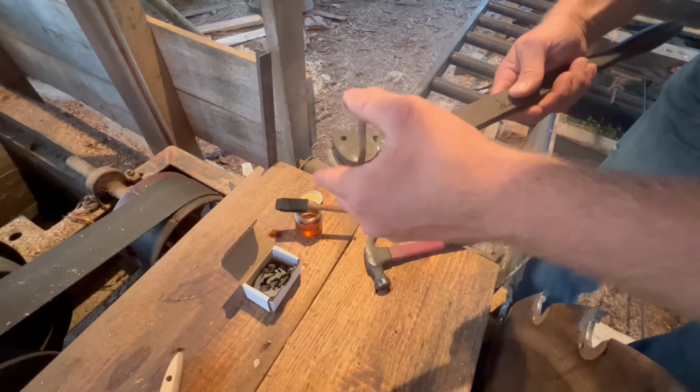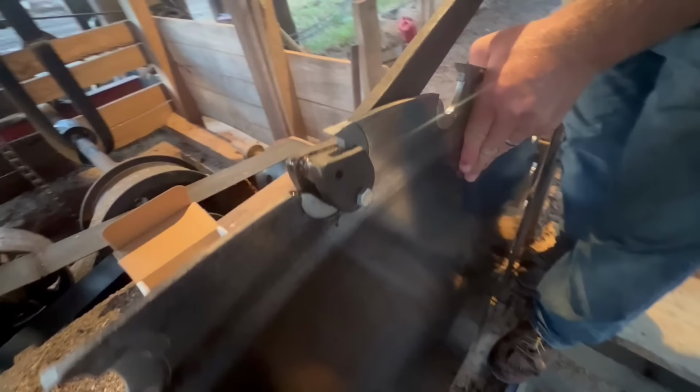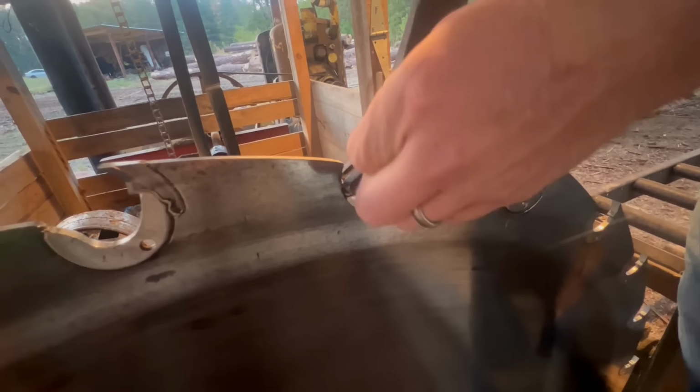All right, now we're gonna roll this tooth back in. So you set your shank straight in like that. Take your tooth, get it started, it's got the little holder grabbing right there. You roll in, give it a tap. Slide that out. Then I like to just lightly tap, make sure that shank is set. To the next tooth. Slide it in. Find that. Roll the tooth out.